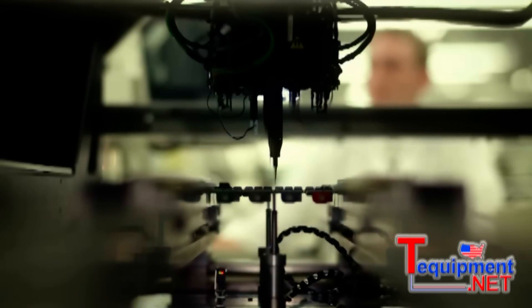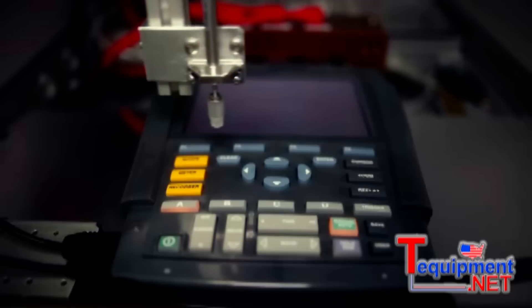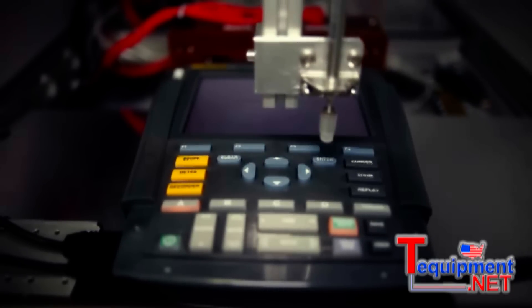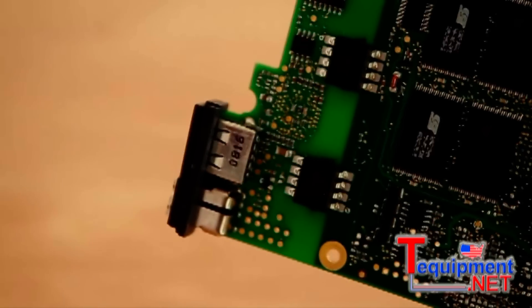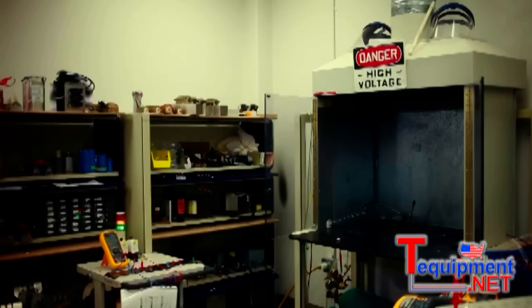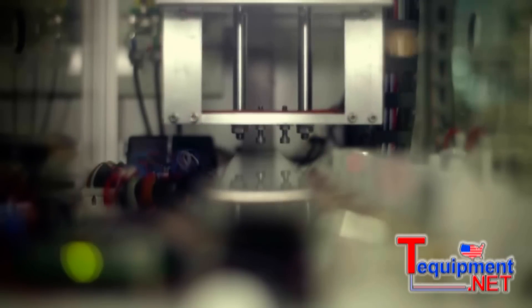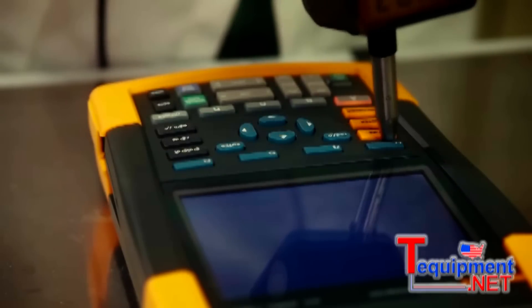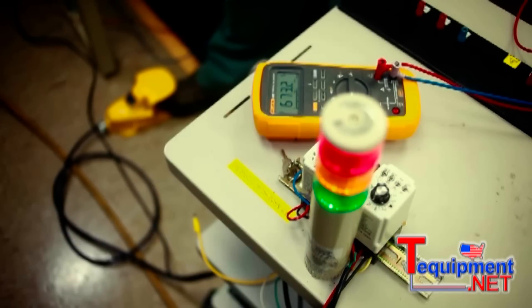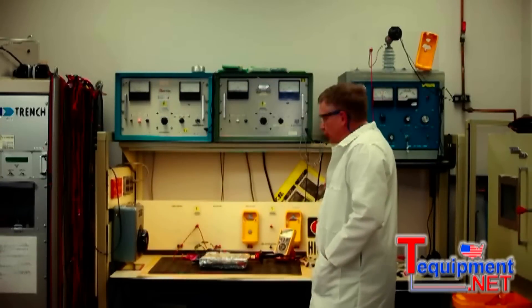For the installation of the instrument's firmware, we set up a test that we run 24 hours a day, seven days a week. It's an automated test that presses keys and enters bits of code, and all the assertions are correctly passed. When an illegal condition is met, the instrument stops, it mentions the line where the condition is a problem, and it starts all over. We try to have the average number of key sequences before some illegal condition is met up to a few thousand. Normally, within 20 or 30 sequences, a user has finished with the instrument. We get feedback from existing instruments, and I'm pretty sure that the 190 series can be used by users who never experience any of these hazards during its entire lifetime.